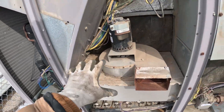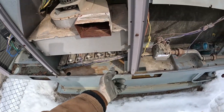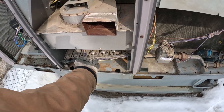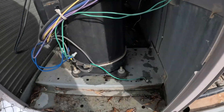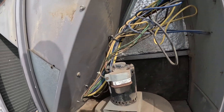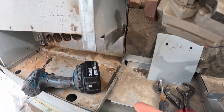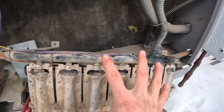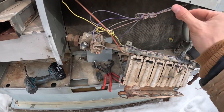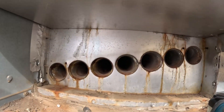In order to pull this thing we're going to have to take pretty much everything apart. We'll have to pull this blower off, probably pull these rails out, disconnect the gas, disconnect the wiring going to the gas valve so we can pull the whole burner assembly out. Then we have to get in here to remove a couple of screws in that sidewall. There are two screws here — removing them moves this plate out of the way — and then screws here and here holding the burner assembly in. Disconnect the union and you can rotate this thing around.